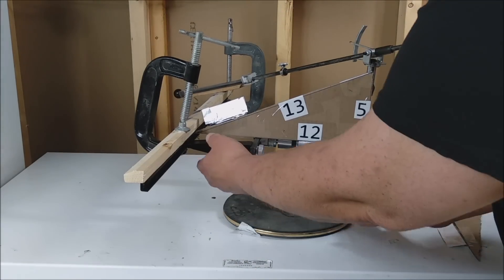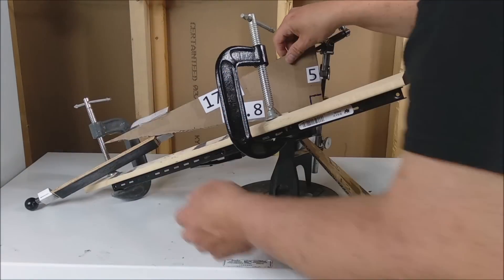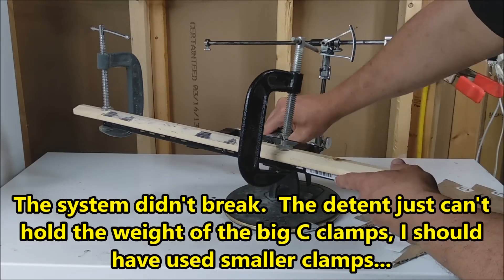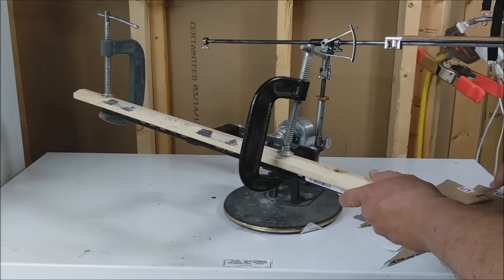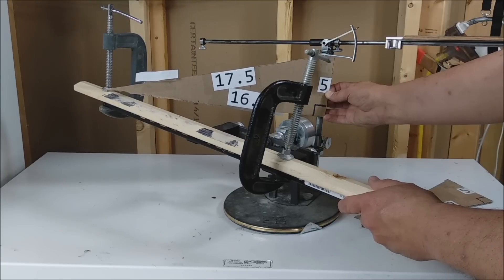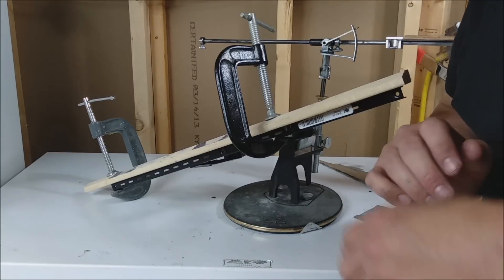So what happens when you're sharpening way over here? That 90-degree angle just doesn't change, and that 5 inches doesn't change. But certainly the length of the hypotenuse changes — now it's 17.5, and the baseline there is 16.8. I used inches for this, and it doesn't really matter what you use. The angle must then be 16.6 degrees. It must be. So I said the angle does change — math proves it. And I thought I was done; I even started editing the video.